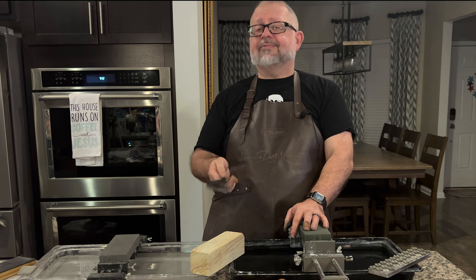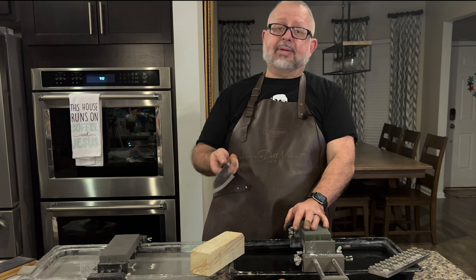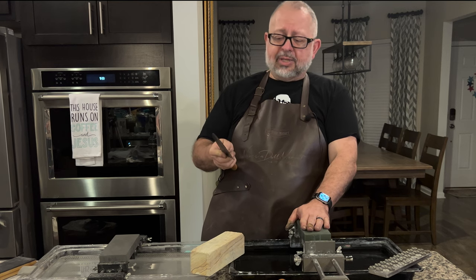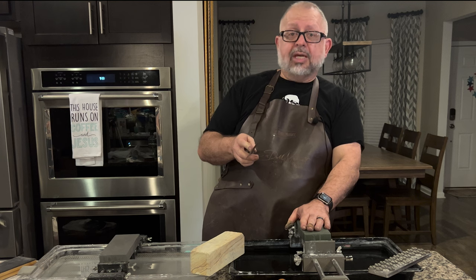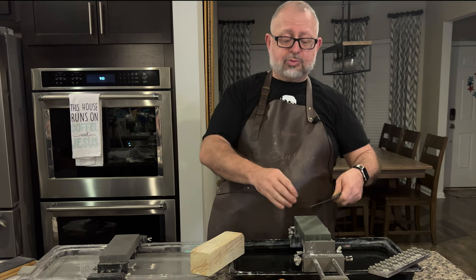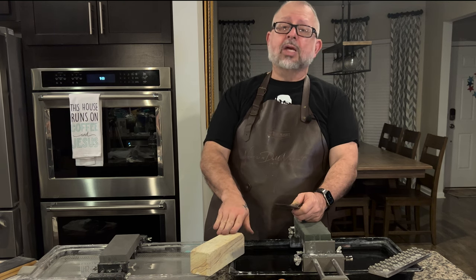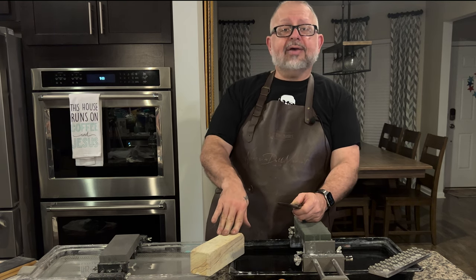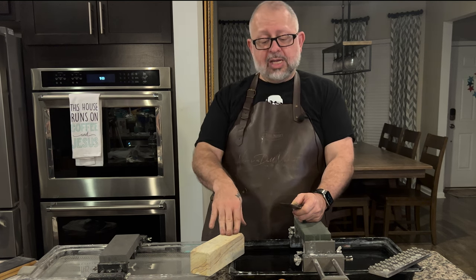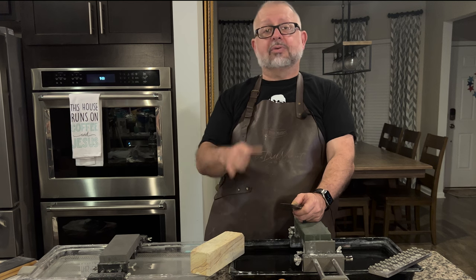Once a burr has been achieved, we flip it over to our weak side — the side we're not as confident in. Whether you flip it to the other hand or use the same hand, what's happening is you're sharpening the other side and you're probably not giving it the same number of strokes. You sharpen until you feel a burr, but a lot of times the burr has just flipped over. So you actually haven't removed as much metal on your weak side as you did on your strong side. If you do that every single time you sharpen, you're taking it out of the 50-50 balance and removing more metal from one side.